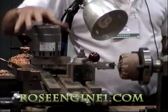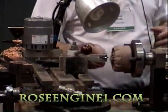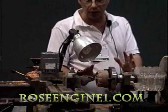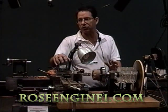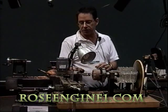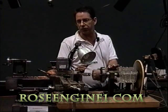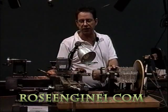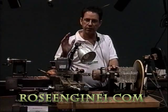One thing you'll always need is a cutting frame. This cutting frame is considered horizontal. It's made with two carbide inserts that you can take out when it gets dull and just change them over, so you don't have to do a lot of sharpening and it works great. Full out it's running about 20,000 RPM. You don't need 20,000 to cut most everything. A rheostat is nice because these belts will fatigue after a month or two and they'll break if you run them at 20,000 all the time.